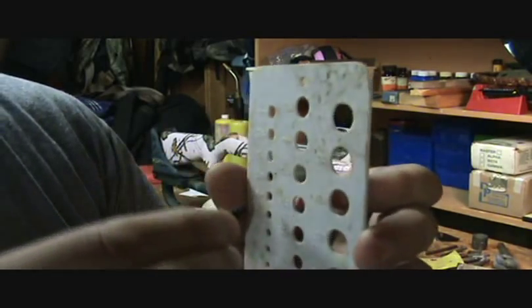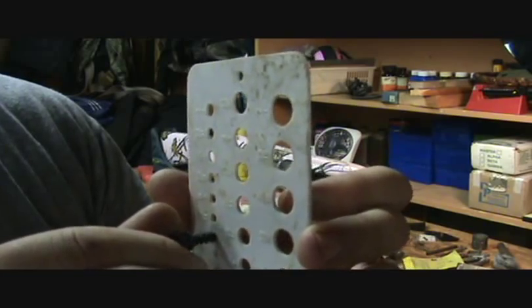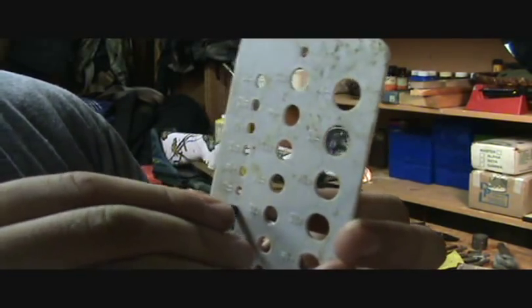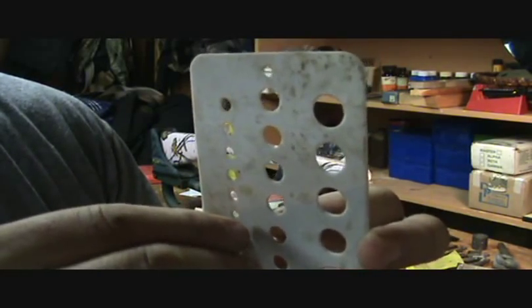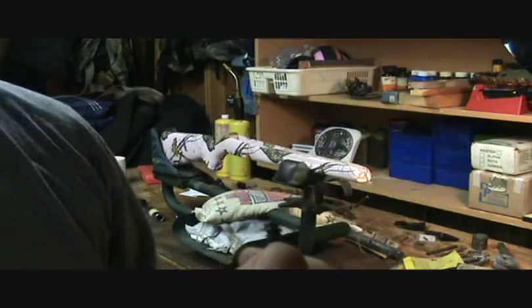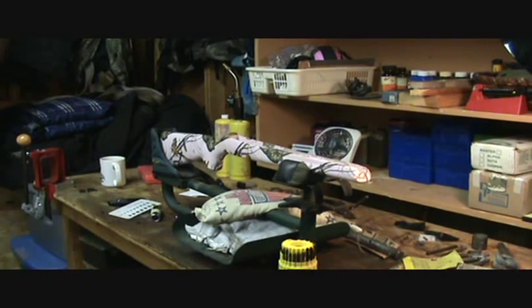For the back, I don't like to go by the size of the teeth, because the teeth are what needs to grab the plastic. Go to the smallest one that allows the teeth just to start. So for the back I'll probably go to a 5/32nds, because that'll allow the bolt to start - that's about the width of the bolt but smaller than the teeth, so I'll get a full depth grip by the rear teeth.